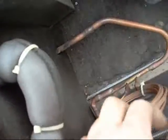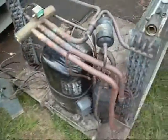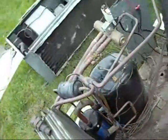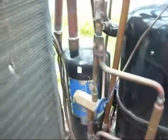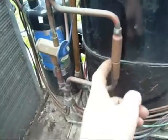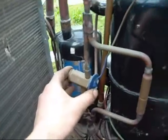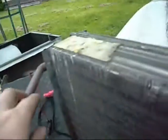This one here is fitted with a little piston type metering device for when liquid does travel through it, or this one here is fitted with a TXV and a piston type bypass. I've never seen anything like this before so I might be wrong about it, but that looks like a piston type check valve or expansion valve, and that is definitely a thermal expansion valve — it has a sensor bulb strapped onto this line here which goes into the coils.